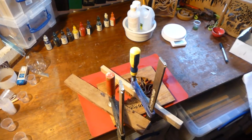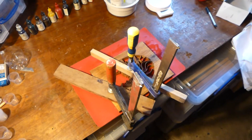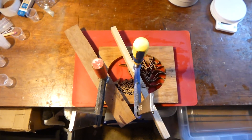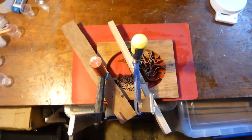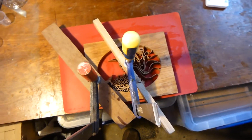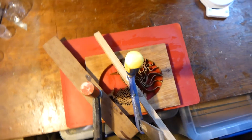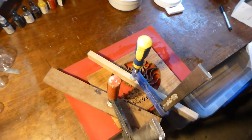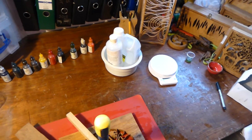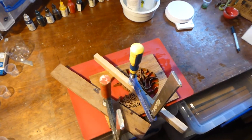Resin doesn't like cold and dust so I've come indoors for my resin pour. I've clamped down my piece of work quite tightly onto basically a silicone baking mat with a bit of beeswax on it to provide a release agent. I'm concentrating on one little corner at a time because inevitably after I've cut it the wood is never perfectly flat and I don't want any leaks. So I've got my resin and hardener now warming up in a little basin of hot water. Scales and bits and pieces — the cat's locked out, so here goes.